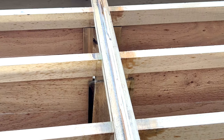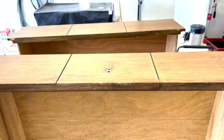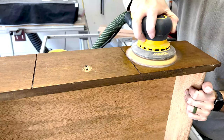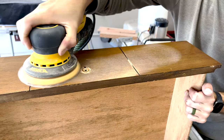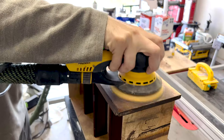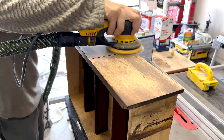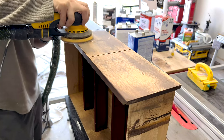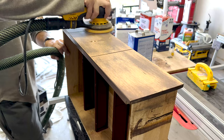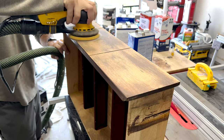So after that Scotch-Brite that I use to take the citrus strip off, I'm going to use a little bit of lacquer thinner, clean it off. What was really strange about this finish was that it actually didn't respond to any solvents really. So the only thing that would take it off was a citrus strip, which is kind of strange. Usually lacquer thinner just burns an old finish like this away. And I don't think it's a conversion varnish because I tried mineral spirits and some other things like that on it. And really, nothing would take it off. So, yeah, I don't know.